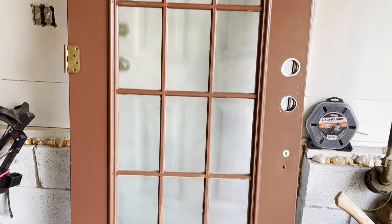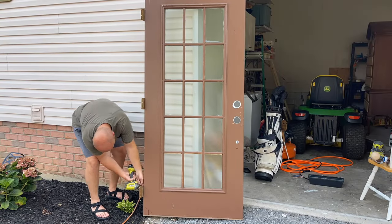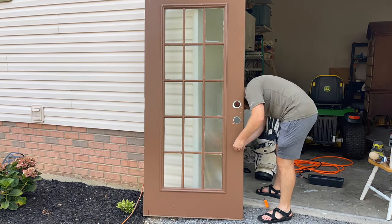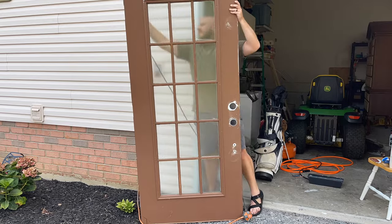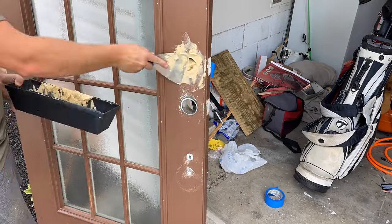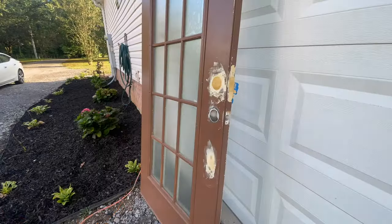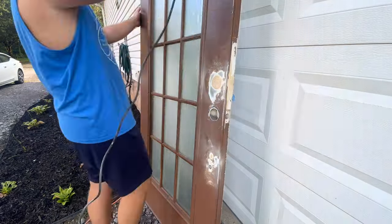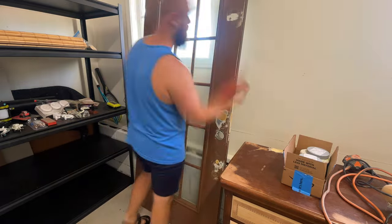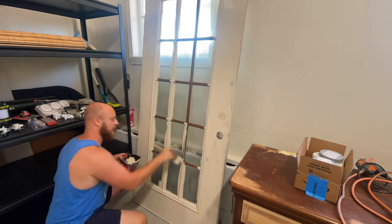We found this door on Facebook Marketplace and it was super cheap. At first I was really hesitant because it's an exterior door — it had two holes, was in rough shape, and had security fasteners on it. But I thought let's just see if we can make this work for a pantry door. So I sanded it all down really well, filled the deadbolt hole using rock hard putty — taped the back and puttied all of the holes — then sanded and sanded. I wasn't sure how well it would work on a metal door but that rock hard putty is really amazing. After that I wiped it all down and painted it our trim color, which is Dainty Lace.